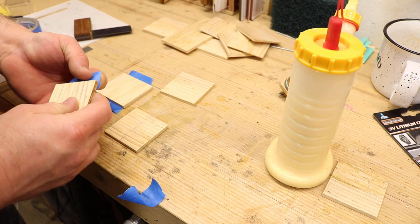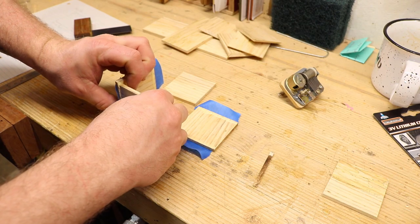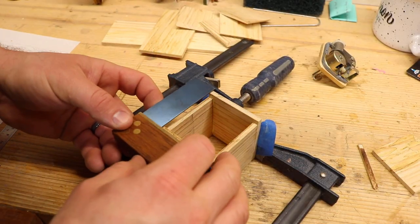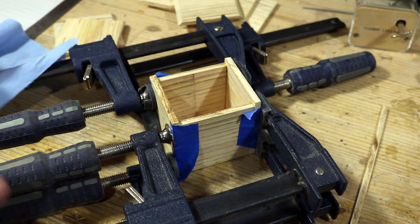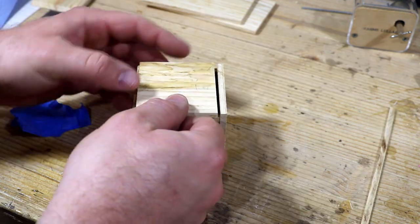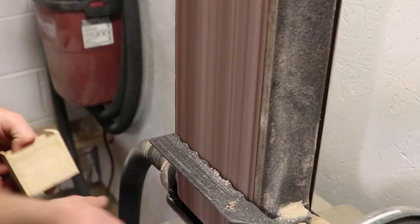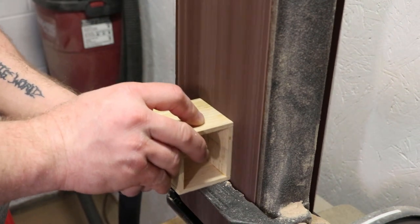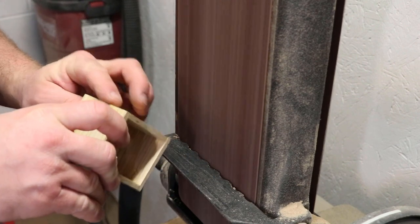Right here is where I skipped all of that - I had already recut them with no miter. The miter was going to be really cool, but I didn't like the fact that it would be end-grain to end-grain, which is generally a weaker joint. And then I couldn't do the lid the way I wanted with the hinge or even a little pin. So I scratched all that and threw them away. You can actually see one of them in the back with the mitered corners - that was some of the wasted wood. I ended up using one piece underneath the lid to hold it on nice and sturdy.